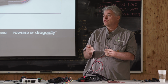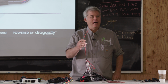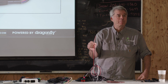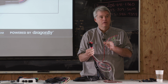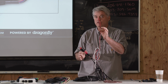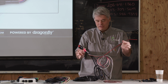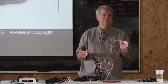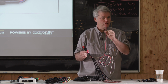We needed the white wire because for some of the BMSs we talked to, that's our feature input. And you'll notice we have a red and black wire and only one pair. There's not two pairs of red and black wire. We actually combine the two pairs inside the connector here, so you only have to hook up these two wires. There's a little bit of loss of efficiency because we're sensing voltage over the same pair that we're pulling the high power for the alternator, but this thing's only 4 feet long. So the loss, the delta, the inaccuracy or reduced voltage is nominal. The cleanliness of doing your install is a benefit.